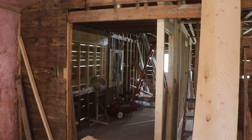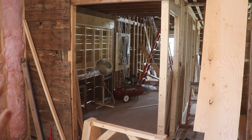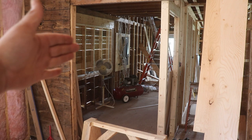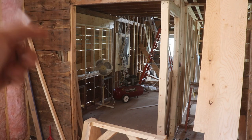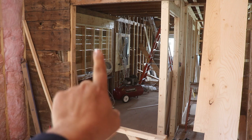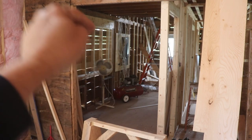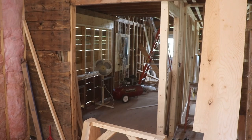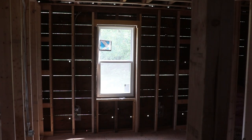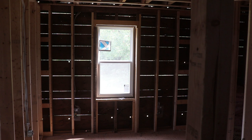The living room used to be kind of cut in half — a chunk of the living room on one side of the walkway. We're going to partition across the face of this all the way underneath the staircase, so there'll be a washer and dryer built in here with some storage beside it, a place for a deep freeze beside that, and a little blocked-off place where the panel is and the entrance to go to the basement under the stairs. The bedroom walls were all built out with two-inch rip to the right width to make them the same as two-by-six walls for insulation purposes — we're going to do that in the whole house.